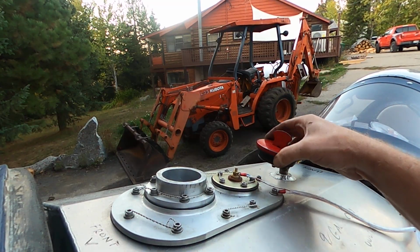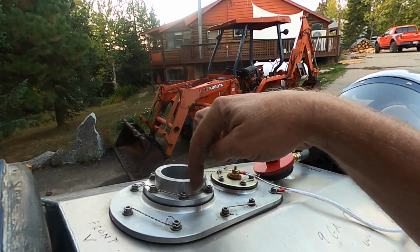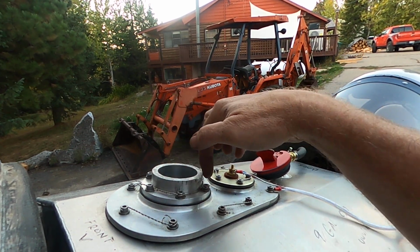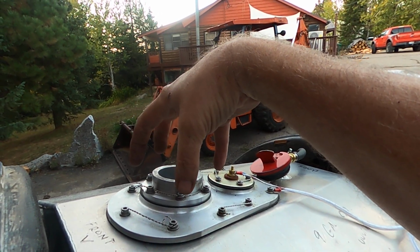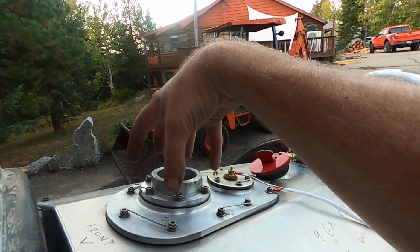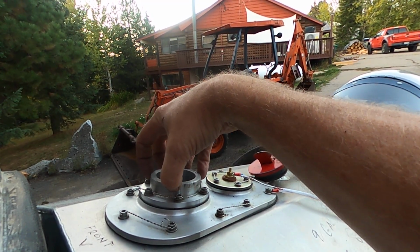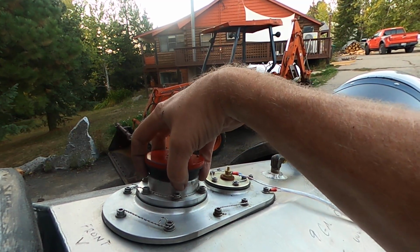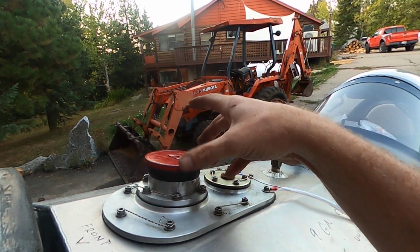So I've ordered a piece of 3-inch tubing with a 2.5-inch diameter. This is slightly larger than 2.5. I may have to trim it down a little bit. So I'm basically going to heat that ring up nice and hot, slip it over, and let it cool off and seize to it. And then this will fit inside of that 2.5-inch inside diameter and seal. And I'll have a proper sealing gas tank.